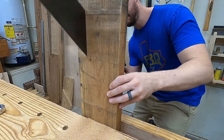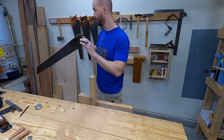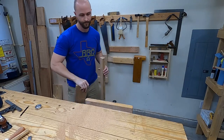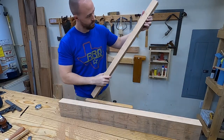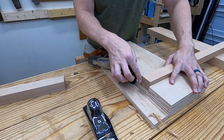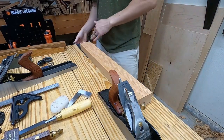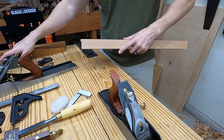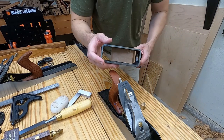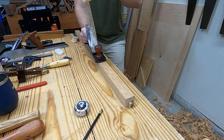I rip these components to size and nearly lose a foot. I position the low end away from me to avoid tear out. I trim down the handle pieces so that it fits just inside the metal bracket. Then I give everything just a quick smoothing pass.